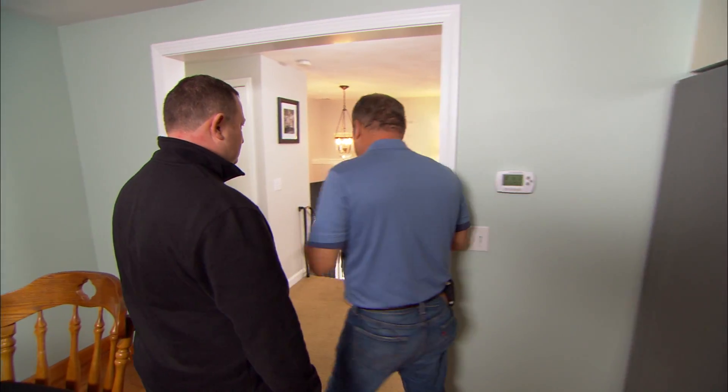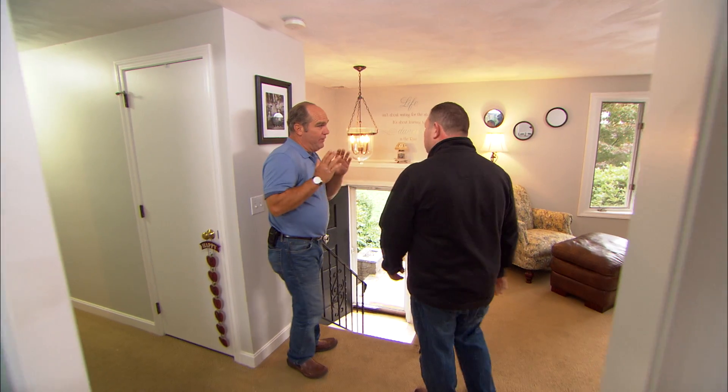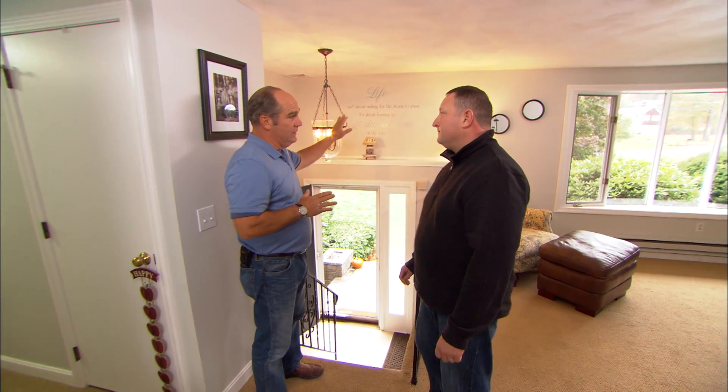With all this in place, you now have an inverter system, four zones, and even on a five-degree day outside, you should have plenty of heat to heat this building. What's really nice is that each air handler, for good measure, has an electrical element that's good for backup and for boost.